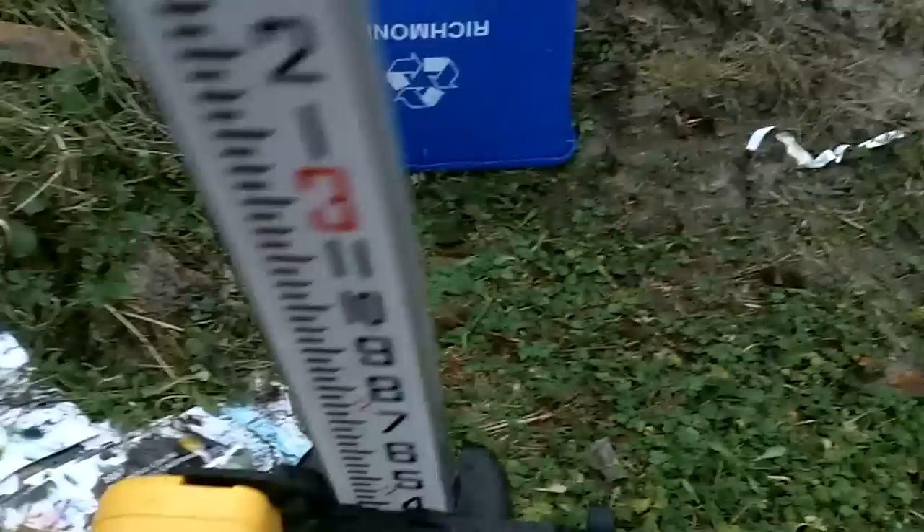So we now know that that's the top of our floor. Now we need to add on 30 inches — 18 for our footings, which is what we use here, plus 12 for the sand. So we're going to take this and move it up 30 inches, and I'll do that now and show you what we end up with.